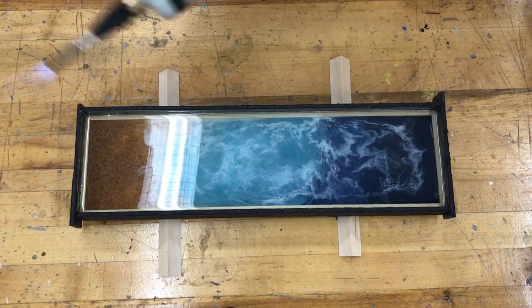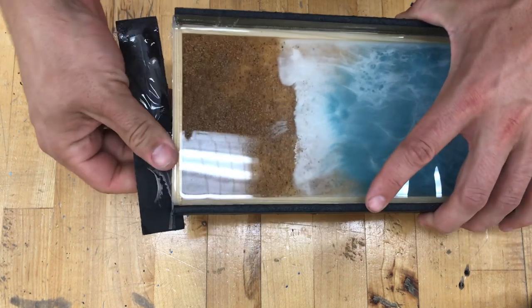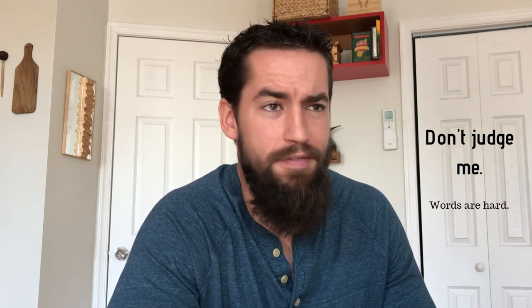I am usually pouring in something that already exists or just doing a very tiny pour in the corner of a piece, so there's not a lot of weight involved. I will often use foam core as an alternative to creating melamine forms. Those are really important for big tabletop pours, but for tiny pours it's not going to be an issue. I face it with plastic tape and it works great. If you're doing anything bigger, use a rigid form so the weight of the epoxy doesn't crush it and end up all over your shop floor.